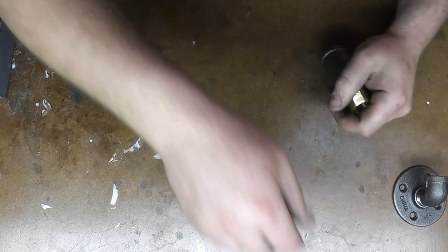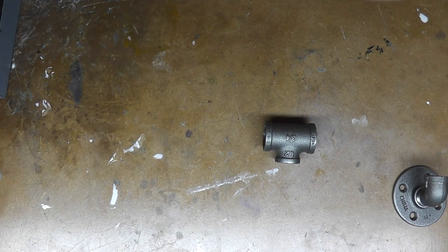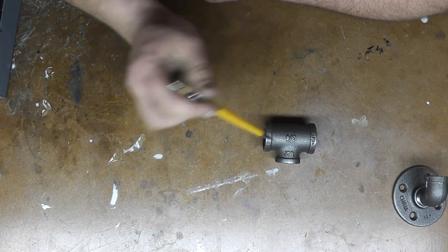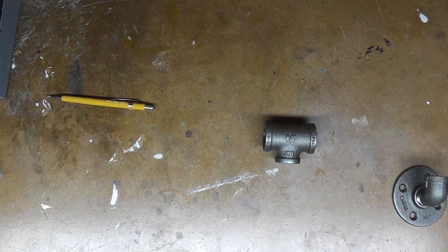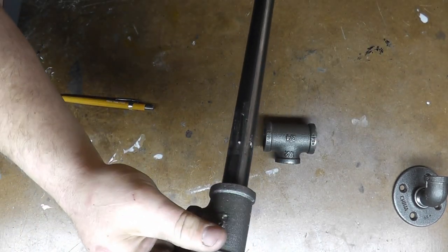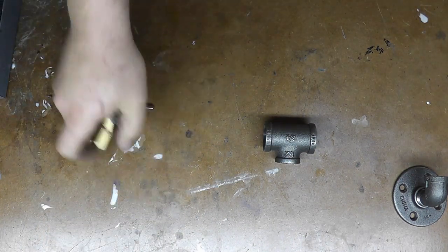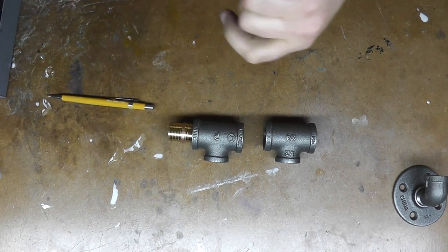Now the carriage itself is going to be made from black iron tees. And what this is, 3/4 inch by 3/4 inch by 1/2 inch. So the 3/4 inch here fits over. Now you can see the play in it. And how we're gonna take care of that is we're gonna use these brass